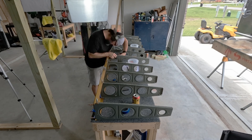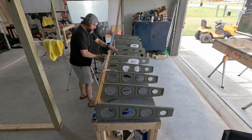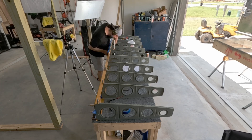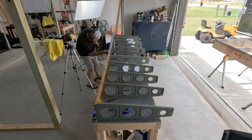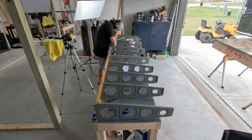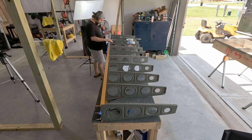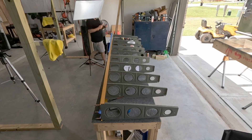You can gently bend those flanges out of the way, but not enough to use the shorter rivet set. You'll see me at a certain point flipping this assembly back and forth from one side to the other. Some ribs I have to hold the rivet with my right hand, some with my left. When it comes to flush rivets on the skins I'm pretty ambidextrous, but these are fairly difficult to set, and I was not getting good results with the rivet gun in my left hand.